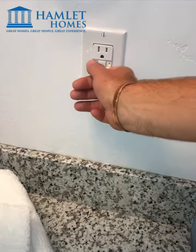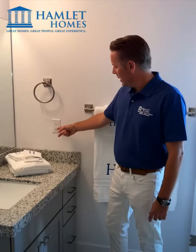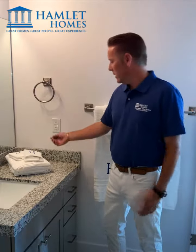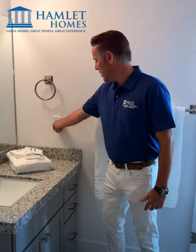Here's how you reset your outlet — and this is actually something you should test every 30 days. When your outlet is off, it's tripped. If you'll notice, I push this button right here. This light came on, which means no power is going to that circuit. To reset that circuit, first unplug anything in the outlet and then simply push the reset button. That outlet is now live and ready to go.